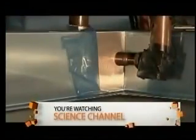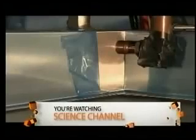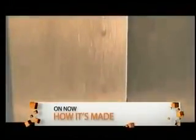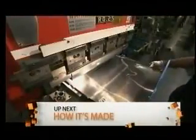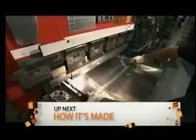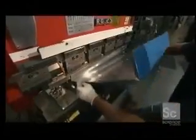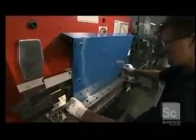Here, a spot welding machine joins two corners of the hood's housing. This is mainly for aesthetics. A weld looks better than a screw or bolt. This 80-ton press bends the hood's shell, making one of eight folds that give the component its final shape.